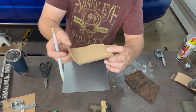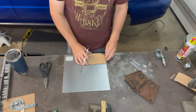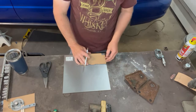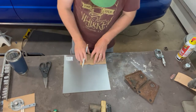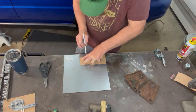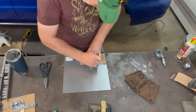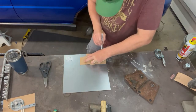Got the template — I'm going to flatten it out and transfer it onto this 16-gauge material. 16-gauge typically mics around 1.5 millimeters or 0.060 inches. I'll take a pencil, trace the template out, then take it over to the band saw, cut it out, mark the bends, and put the bends back in the sheet metal.